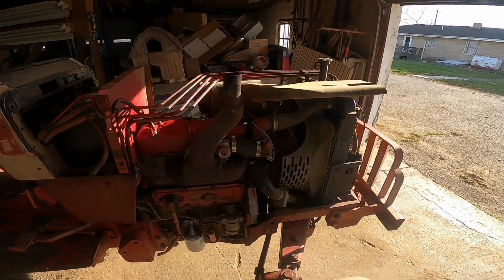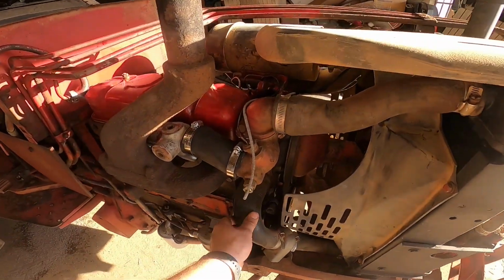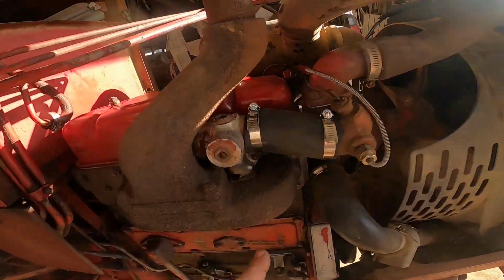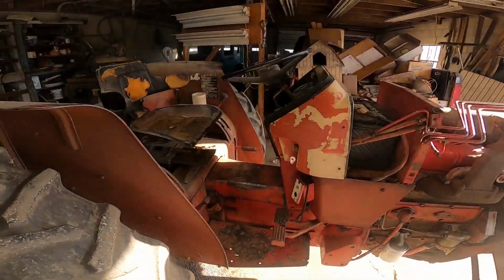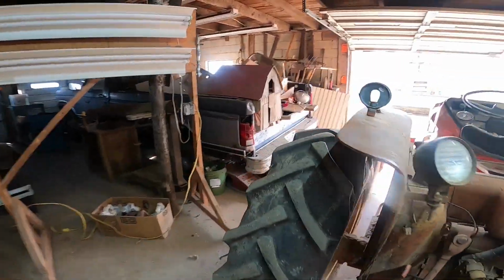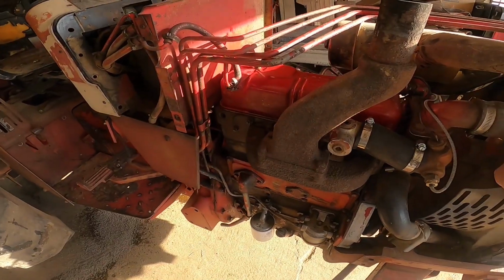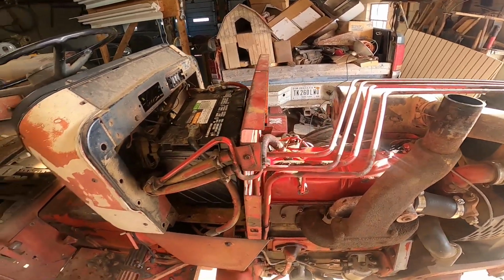All right, guys, I let it run for about 15 minutes or so. Everything looks pretty good. Wasn't blowing any hoses off like before. Switching out the head gasket was definitely the problem. They wouldn't last 2 minutes on there before, so good deal. Got a little oil leak coming out of the valve cover. These stupid cork gaskets, but I'm gonna be adjusting the valves on it anyway, so I'll be pulling that off, and I'll probably put some RTV on that gasket. That way we don't have that leak next time. But yeah, sounds good. The shroud on the fan needs a little adjusting because the fan was hitting the shroud. You can probably hear it in the video. Definitely you can hear it needs a little adjustment in the valves, but that's no big deal.